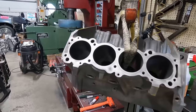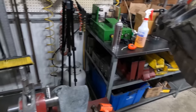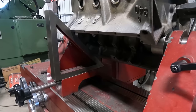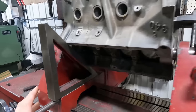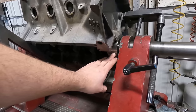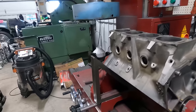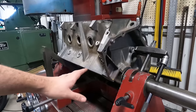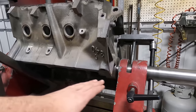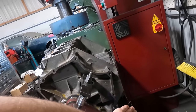Now we're going to get the Buick 340 up on the machine. I've got the rings that fixture the block on the main journals, and these are the right size rings to perfectly fit this block. You can see here what the fixturing looks like. This fixture is better than some because when we're done, everything is aligned off of basically the main journal of the crankshaft — the axis of that main bore. We're at 45 degrees to the pan rail, which means when we flip it over to the other side, the deck is going to be perfectly parallel with that main centerline, and this deck is going to be exactly 90 degrees to the opposite deck.